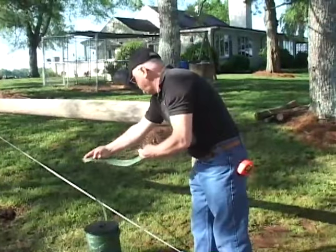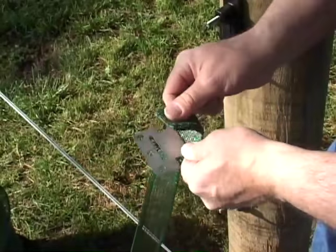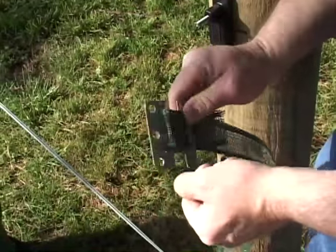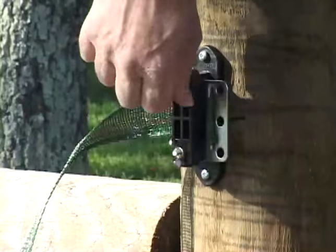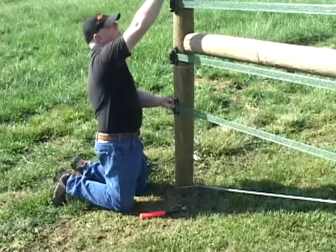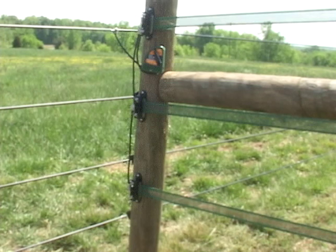Back to the end post: once you've unscrewed the outer half of the end post insulator, fold the end of the tape over, leaving 3 to 4 inches of tape. Place through the bottom slot of the plate without the three holes, then roll the tape over, inserting it in the slot nearest the three holes. Insert the keeper pin into the keeper hole, then pull back and secure the tape — when correctly installed, the plate should not be able to move. Place the metal connecting plate in the insulator and reattach the outer plastic half, finishing by installing the stainless steel wing nuts snugly. Unroll the tape to the other end, pull tension on the tape to make it tight, then lock the insulator in place with a hammer. Apply tension on the opposing end post, fastening the tape with the same method. Repeat this process for each insulator on the post. To connect power to your one and a half inch tape system, please refer to the installing the energizer section of this video.